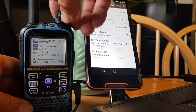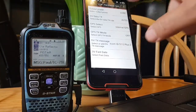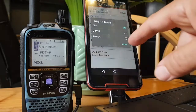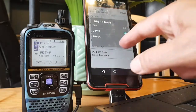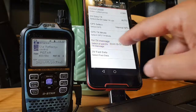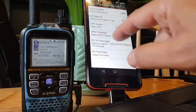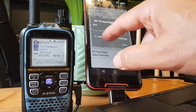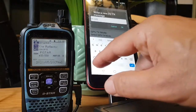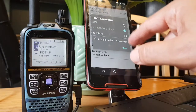You can see the radio is receiving stations there as they key up. Output power Low, DV Data Auto, GPS Internal, GPS TX mode is Off — and if I turn it on we'll see what happens. That seems fine, so it will transmit on Reflector 30. DV TX message is On. Let's do the Add New Message thing — hi M0FXB — click OK, just leave that on.